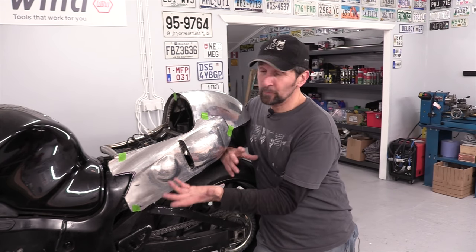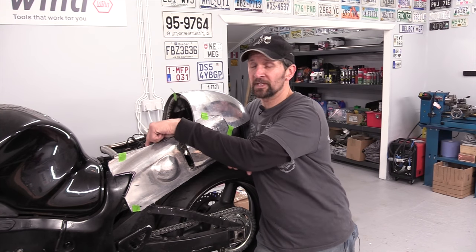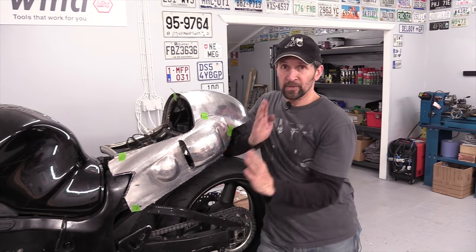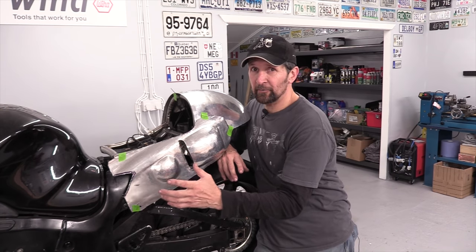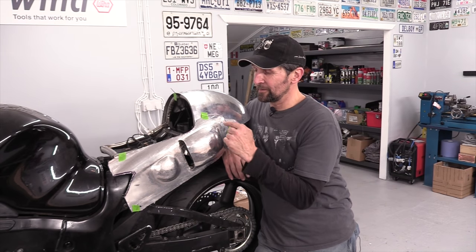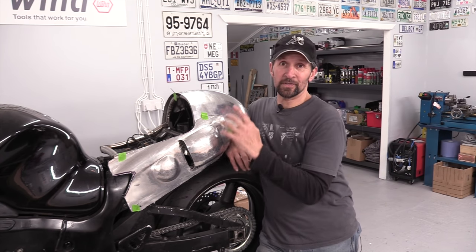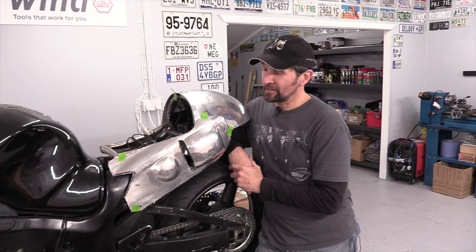And then instead, make a flat panel. I mean, it won't be entirely flat because it has to have this curve at the front to come from the seat frame out to the outer frame because they're slightly out of line. But it will be basically a flat panel with 2 holes cut in it to go over those pockets and then rivet them round again like an aircraft style, and then rivet that to the tail as well. So the whole thing will start to look pretty cool. So I think I'll go that way instead.